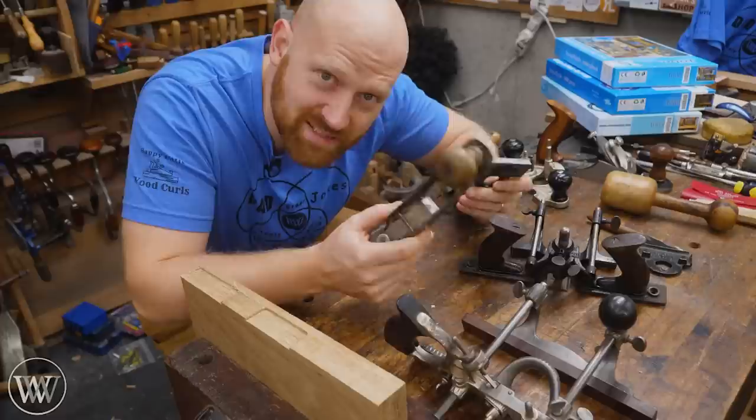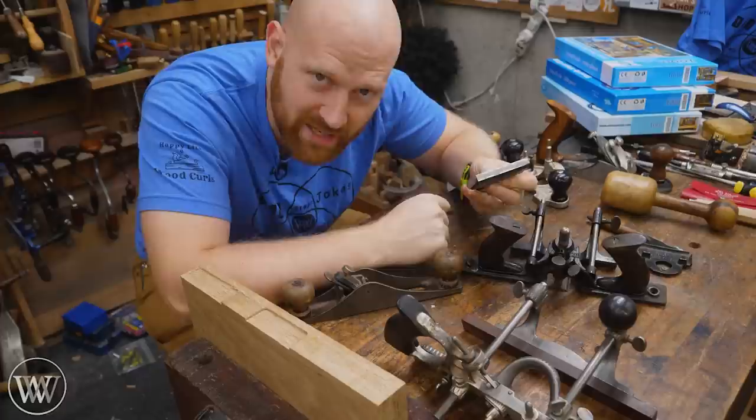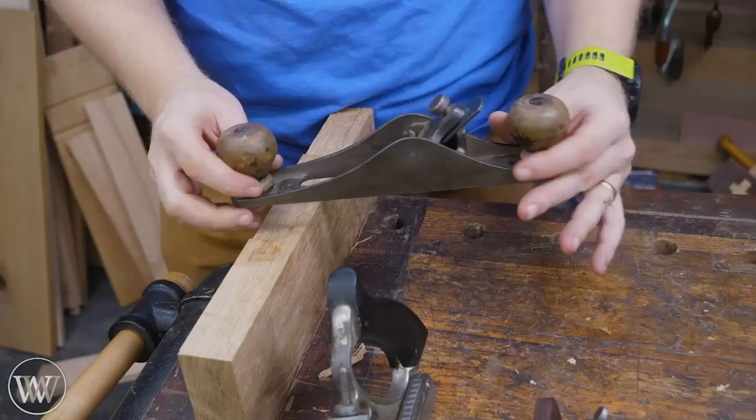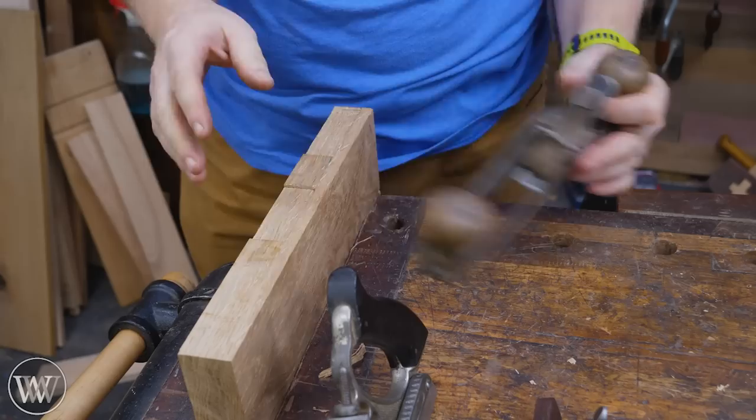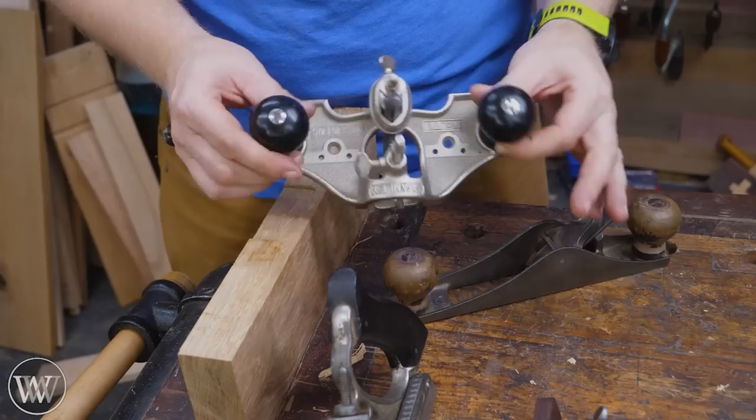So because of that, there were lots of tools in the market dedicated to installing hinges and installing locks. It just made the job easier because it's kind of tedious. And if you have a tool that does it really well, then you've got a tool that you can use and make money with. Stanley had the hinge butt mortiser. It may look like a scrub plane, but it's actually a router plane — a very simple router plane. What it does is it comes in and rounds out the hinge butt mortises so you can get a mortise slot for the hinge to fit into. It works fairly well, but the problem is it's all about skill. There's nothing to hold it in place, and you can't do it really well with the 71 because on the edge of a door there's just not enough stability.